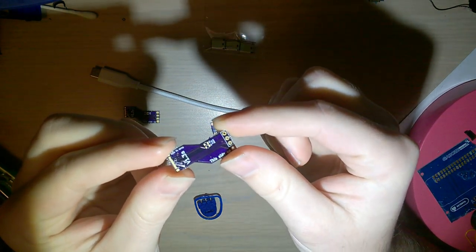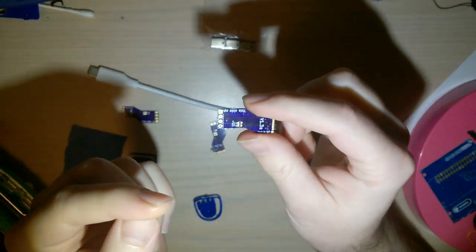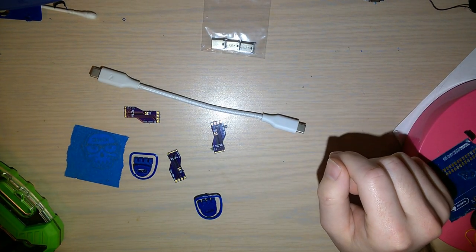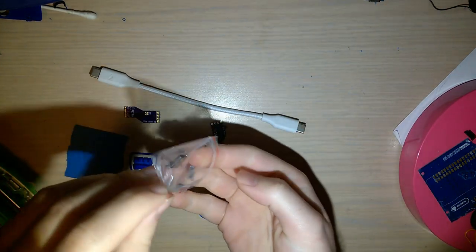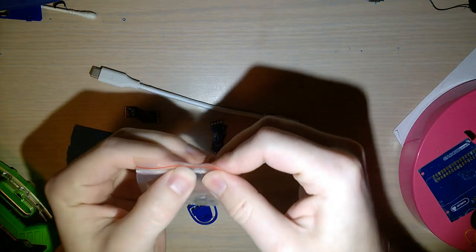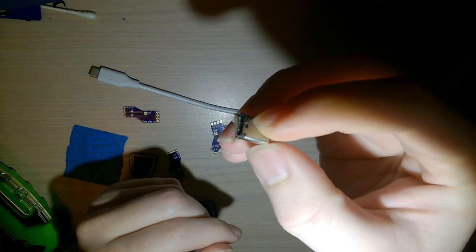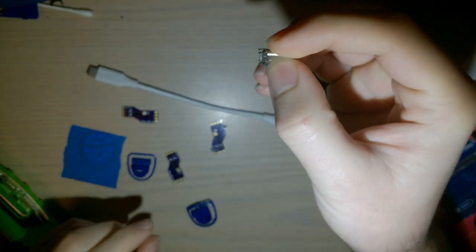They're kind of customized, but basically the idea is you solder on a USB-C port, and then you solder this straight to the board, and you're good to go instead of having to fuss about with wiring up the breakout board like I did originally. It's probably a little bit harder to set up because you need these USB-C ports here. I just bought them off of AliExpress. You have to get the ones that straddle the edge of a board. You can kind of see that there.